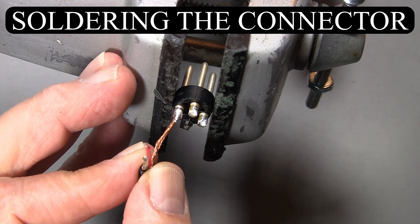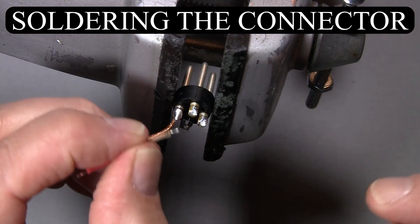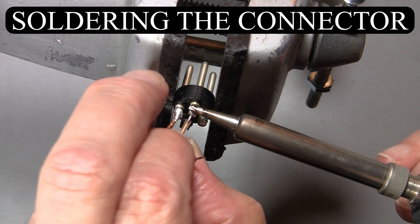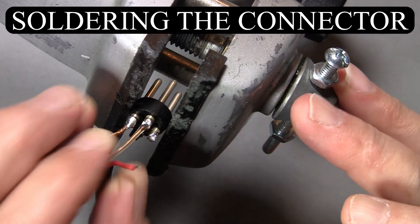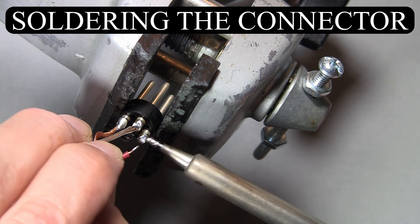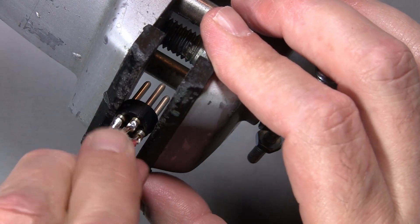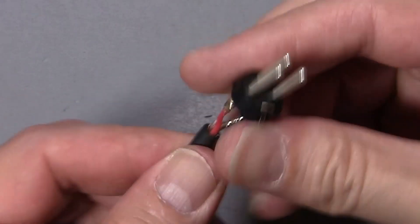The center pin is pin 3. Pin 3 is cold, so in this case that's the clear wire. Bend it so it's ready to go right into position. Heat the XLR, insert the wire. That's pin 2 on the right — heat the XLR, insert it. Straighten it out. Not bad — I've seen better, I've seen worse.